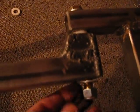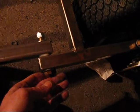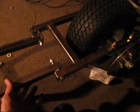I put the two together. What I used is the 7/16 bolt. I have a washer, then a nylon spacer — right in between there, maybe an eighth inch thick — then another washer, and then the end of the bolt. I haven't tightened it down yet. So it's the bolt going all the way through, a washer, a nylon spacer about an eighth inch thick, another washer, and a locking nut. That's what's going to act as our swing arm.